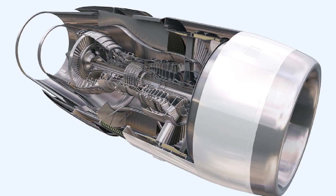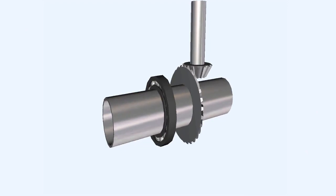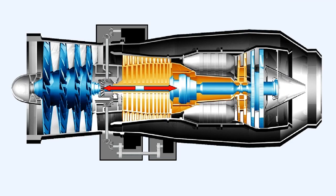Axial movement of the compressor shaft would cause the teeth of the bevel gears to move apart, and the drive would be interrupted. Momentary interruption of a drive transferring 400 to 500 horsepower would impart massive damage to the teeth of the bevel gears and probably destroy them. This state of affairs obviously cannot be allowed to exist.